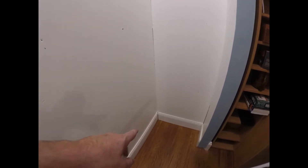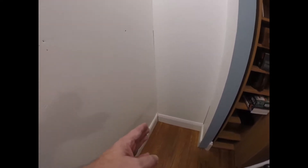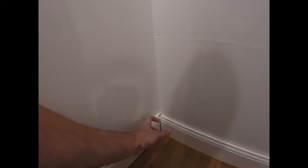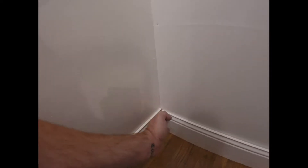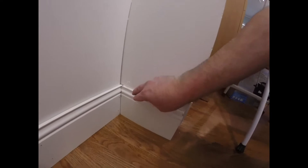I'm having a problem with my miter saw - that's not me messing up the measurements. What's happening is you can see it's cut at an angle. This is custom baseboard that's so tall that when my miter saw blade comes down, the actual nut on the arbor hits the top and doesn't let me cut all the way through. On the first piece I did, when that nut hits there it causes the blade to curve in because I was pushing down on it. Other ones are much, much nicer - I still hit it with that though.